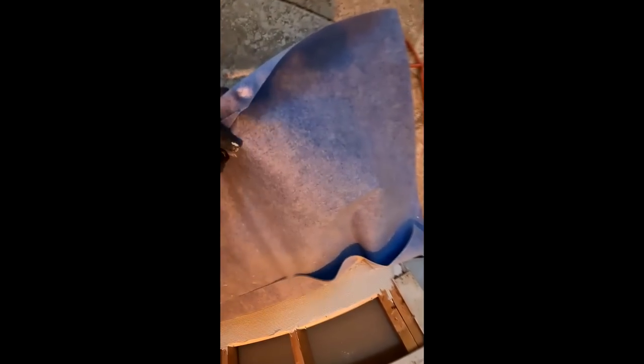So yeah, just kind of getting it as straight and flat and flush to everything as possible to begin with before I start pushing it out. So I'm using a couple of blades. I'm using a margin trowel to kind of hold the material in place, and then I'll use a 6-inch taping knife to push out all the excess thin set. And let me see what I'm going to be doing next. Yep, that's what I'm doing right here.